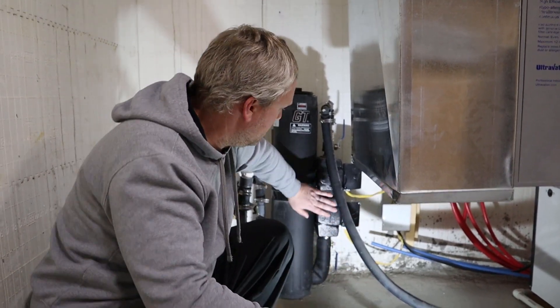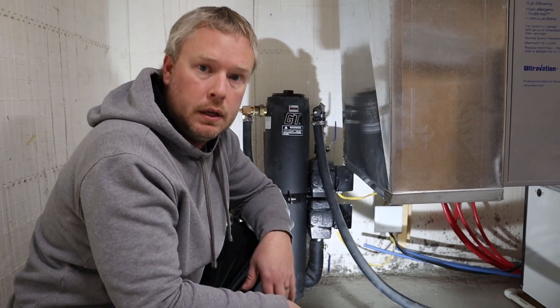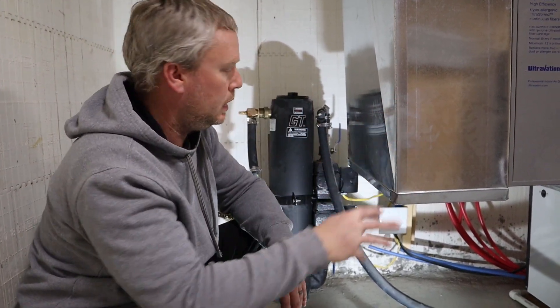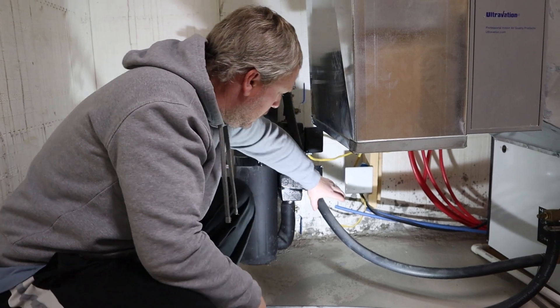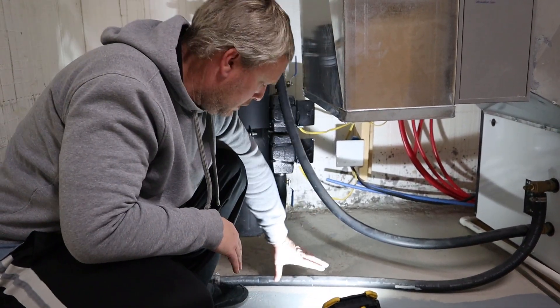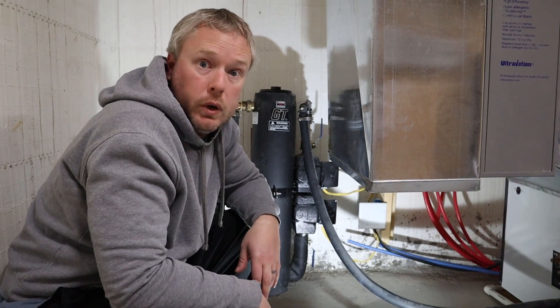The last thing you want to do is make sure your pumps are actually working. These are the pumps attached to this non-pressurized system. The way to do that is to turn on your geothermal unit and get it running, because anytime it is running these pumps are also running. Let it run for a little bit and touch both the in and the out pipe. One of them is going to be a little bit warmer than the other one, and if that is so, they're working.